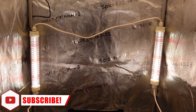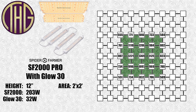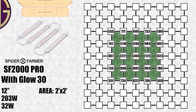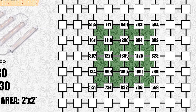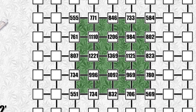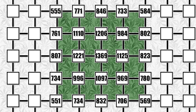With all of that said, let's get into the measurements. Here we have the results with the SF2000 Pro hung at 12 inches above the PAR meter, with the Glow 30 right alongside of it. The SF2000 Pro is turned all the way up for these tests and is pulling 203 watts from the wall. The Glow 30 doesn't have any adjustability and is pulling its full 32 watts from the wall. With the light this close to the floor, the center of the tent is going to see an absolute ton of light, with quite a bit of fall off towards the outside of the tent, as there are no LEDs directly above that area. However, the extra light from the Glow 30 is helping to pick up the slack out there, which is leveling out the light levels a bit more than with the SF2000 Pro by itself.